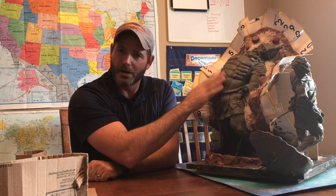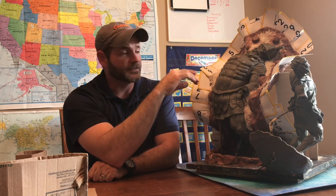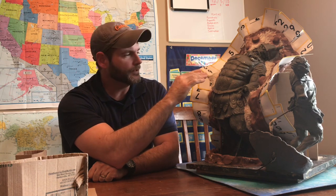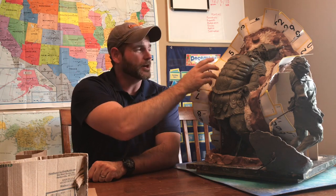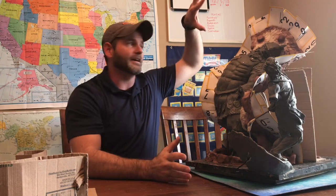This is wax-based clay or modeling clay and you don't want to use modeling clay on modeling clay to make your wall, because sometimes if the temperatures are different it will stick to itself and then when you try to pull it off later it'll ruin the back side of the sculpture. If you look at the back side, the back side is not very pretty — I'm just using things to prop it up. And if you notice I also have this card, this dividing wall made with cards. Not only are you going to make a mold, you're going to make what we call a mother mold, because the mold itself has to fit into something rigid and hard or it'll be real floppy and it won't work. So I create a big wall here so no product ever goes on the back side and nothing leaks through.